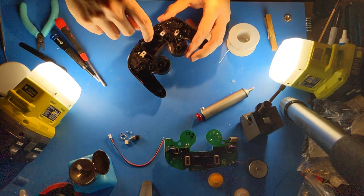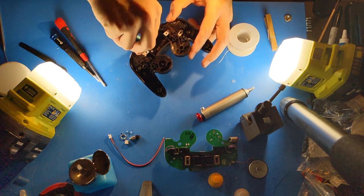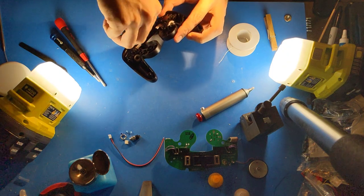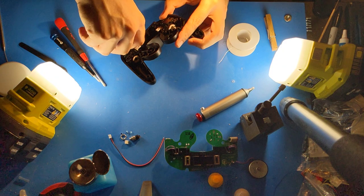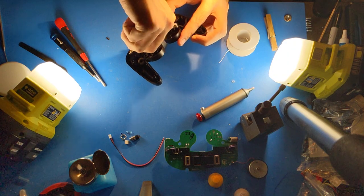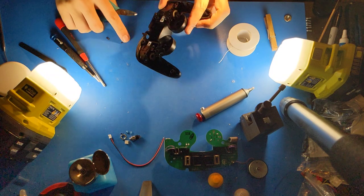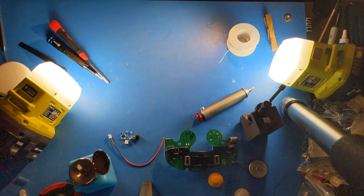Next, you have to clean up this rib, at least on T3 shells. On a T2 or T1 shell, these ribs won't be there, so you don't have to do this step. If you don't remove this rib, then the jack for PhobVision will not fit. That's all you'll do with the backshell for now. Now set it aside.